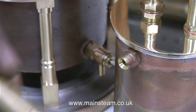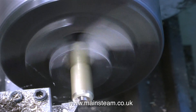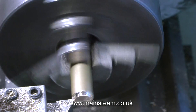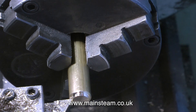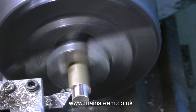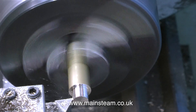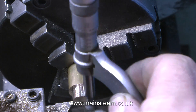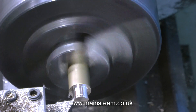I'm going to make this part on the smaller of my two lathes — my little Boxford. First thing as usual is to part off the end of the piece of bar; I've recently changed the tip on this tool so it's quite sharp. Once I've faced the end it's time to take a longitudinal cut. One end is going to be threaded 5/16ths by 32 threads per inch, so I'm setting my micrometer on a 5/16ths drill shank — quicker than turning the little wheel and observing the graduations, though drill shanks are generally a thou or so undersized. I'd always check it by looking at the vernier to confirm position. Sometimes I cut with the tool both ways — going down the work, then turning in a little bit and cutting coming back — because the tool is sharp on both sides, so why not use it?